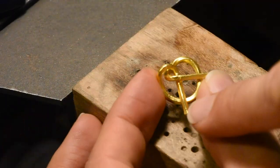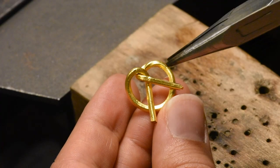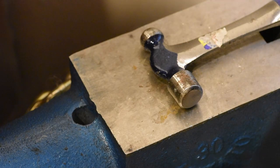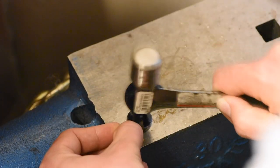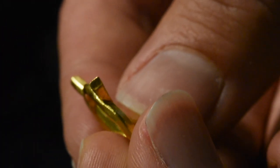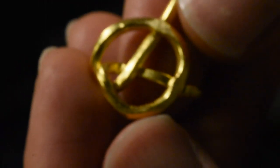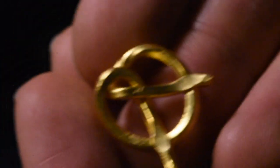Now I've got the shape of a pretzel, but I'm going to hammer it so that it smooshes a little bit. This one goes up, and that one's kind of round and fat. I'm going to smoosh the tails down on the anvil with a ball-peen hammer. See, now what this is going to allow me to do is these are much closer together now, and I will be able to fuse them because they're basically already kissing. So I'm not going to do any more shaping work yet — this is going to be too delicate until I fuse it, so now it's time to fuse it.